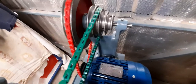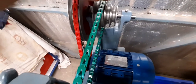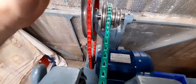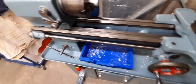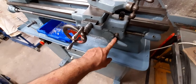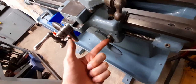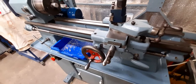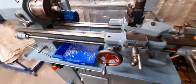I turned a new shaft because the old one was heavily mashed up from a spinning pulley, and I think this pulley wobbled too much as well. I also made new eccentric screws for the half nuts — I posted about those in a previous video. If you twist them you can get a different adjustment on the half nuts, because the half nuts on this lathe are quite badly and unevenly worn, which was causing slipping under powered feed.